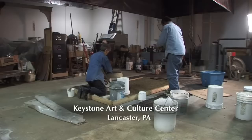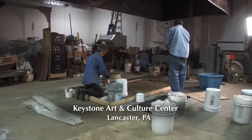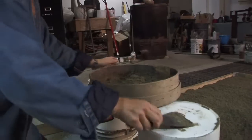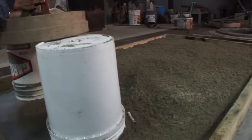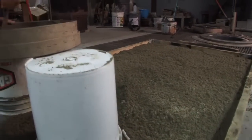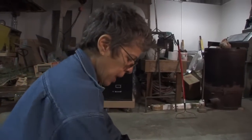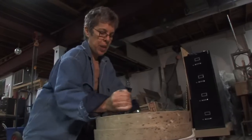It starts in the sandbox. I am putting the sand through the riddle so that it aerates, because later I'm going to be compressing the sand to make the form. When you sand cast bronze, the sand always has some kind of binder in it — this is the most ancient form of casting. The sand is bound with clay: sand, clay, and water.